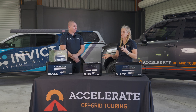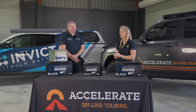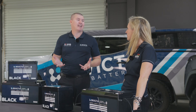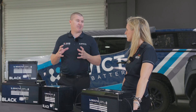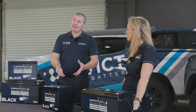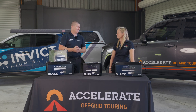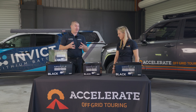A lot of people say lithium is going to catch on fire. Lithium ion is a very broad category — nickel manganese cobalt, lithium titanate, polymer, lithium iron phosphate — they all have different energy characteristics. We use lithium iron phosphate because it has a much higher thermal runaway threshold. Essentially the only way you're going to get it to catch fire is to put it in a big fire and wait. We've literally pulled bullets through these things and they haven't caught fire. Very safe, very chemically stable, and with our build quality, very mechanically stable and robust as well.